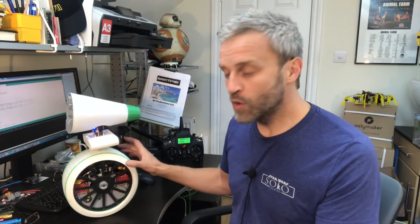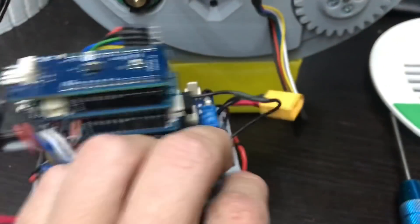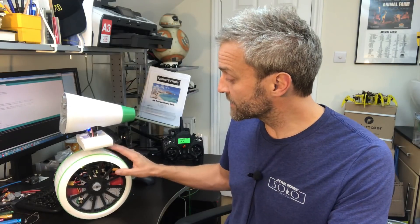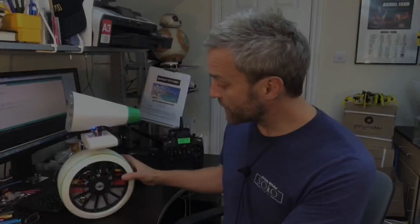On a hard surface it's working really nicely, but I think they're just a little bit under-torque. I did replace the DC-DC converter underneath the electronics stack with a really good quality one — about 50 pounds, not cheap — so I could maybe take it up to 13 volts or more and give it 10% more power. I think the rims are about the right size but could be a little bit bigger. Another option is to make the cog on the output shaft of the motor smaller, though that would reduce top speed. The other alternative is completely different motors, which I'm not keen to do because it's a really nice fit right now.